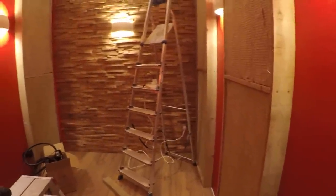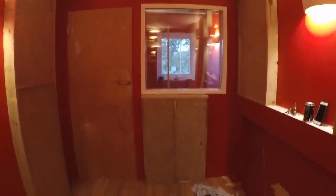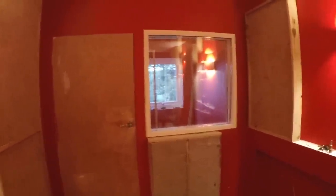The absorbers are screwed onto the wall with 2mm washers to ensure they are not in contact. On the left side, you can see the absorbers do not go from floor to ceiling. The block along the wall underneath them is a passive input vent, which doubles as a shelf for mics and other accessories. With the rock wool wrapped in fabric and the floor beading installed, the live room was almost complete.